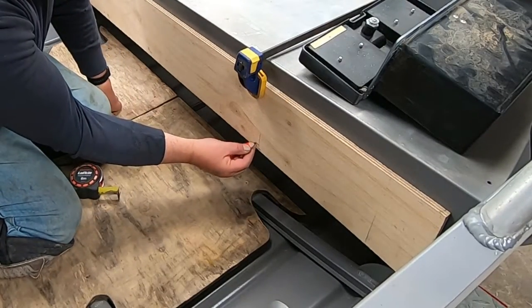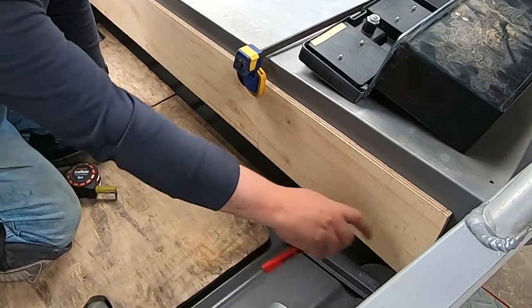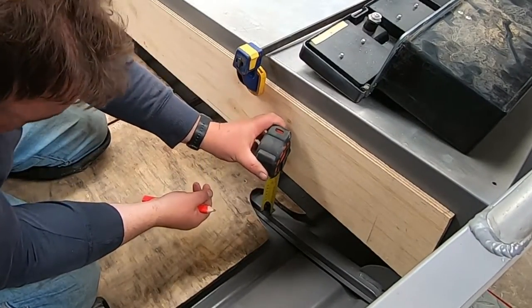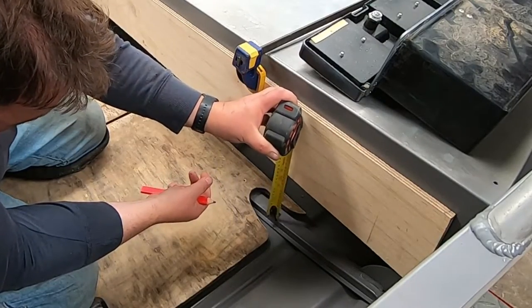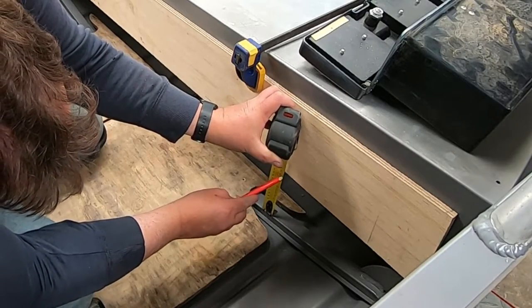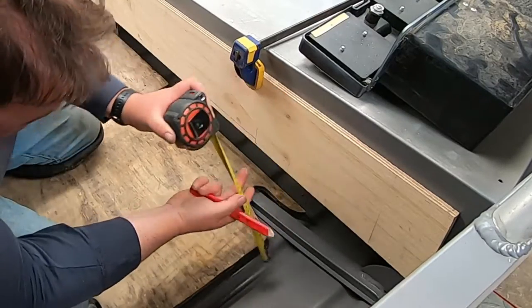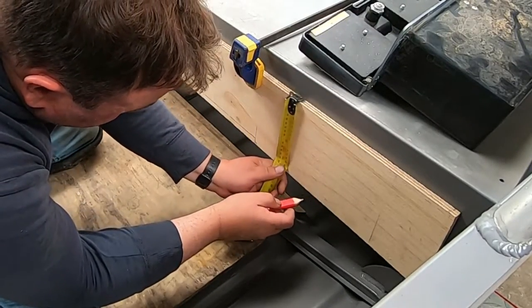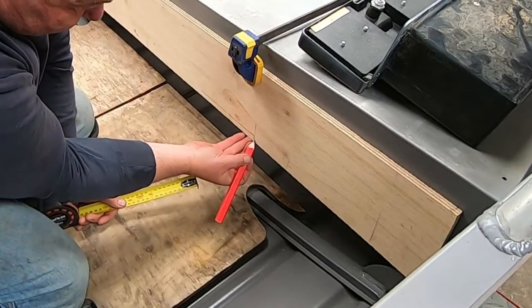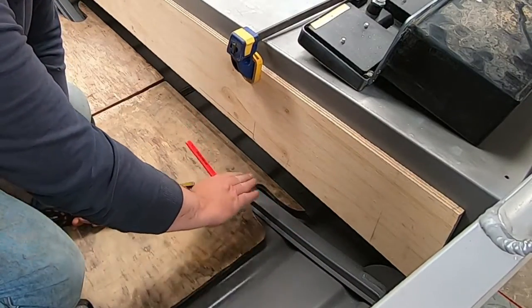So when you start penciling it out, that's going to be the mark, and then we'll slowly come up this way. So if we pick another spot off the boat here, put a horizontal line there, so we've got a bit of a reference point. So that's going to be 140 as well there, so 155 down. That's where our cut line's going to be. So we're now going from this point, heading up to this point, and that follows the contour of the hull.